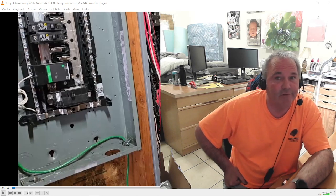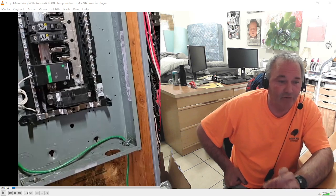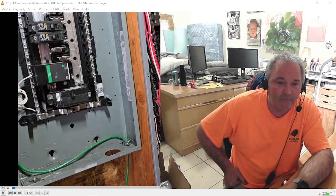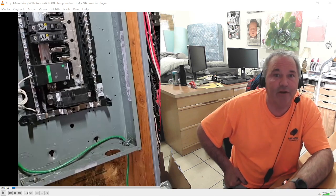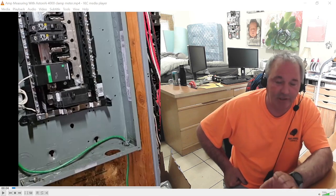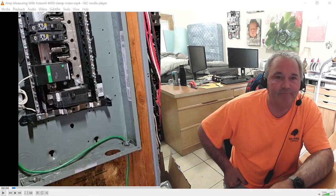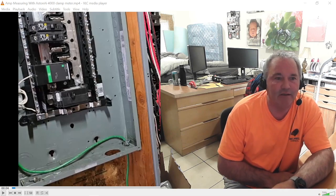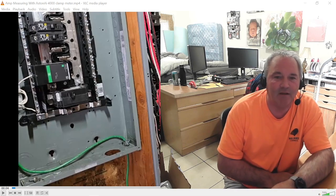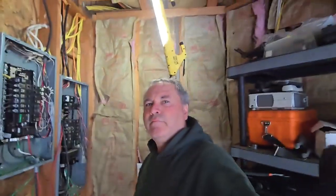This could kill you — dangerous. So be very careful. These little hot panel mini panels, you can't shut off — there's no main breaker, so panels can be hot. Be very careful. If there's a breaker to shut off the main panel, shut it off before you do any work in it. Thanks for watching, and go ahead and hit the like button if you like it.